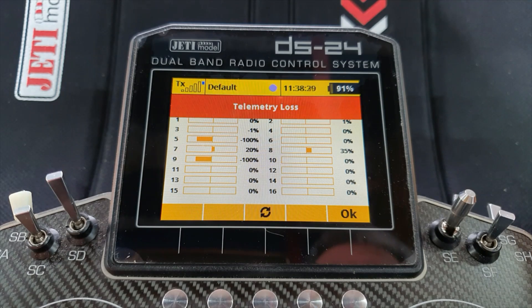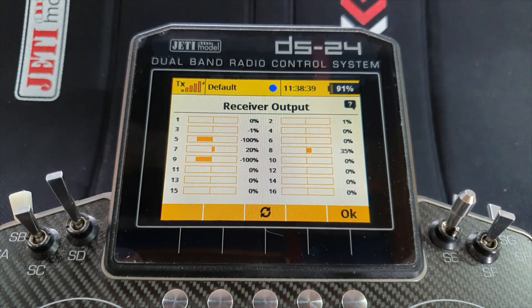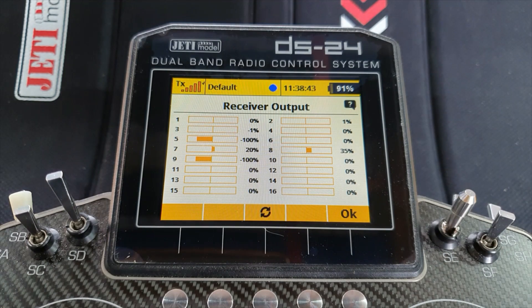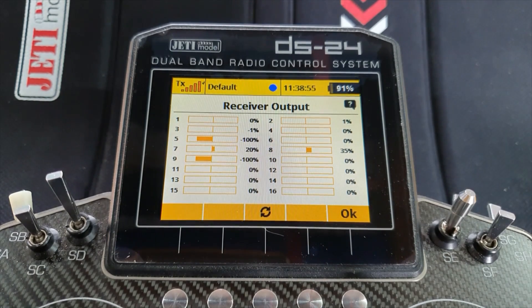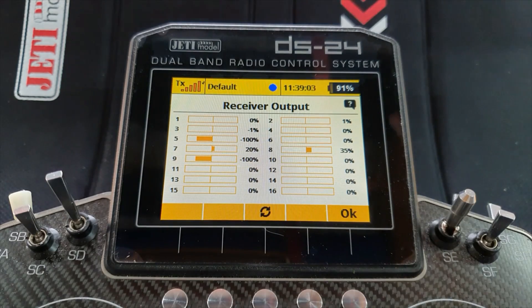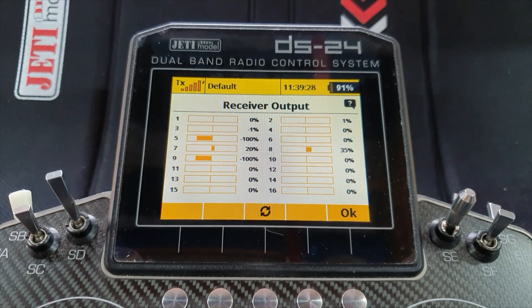I can get it set to the midpoint, then power up. Even if we'd left the throttle back, in an ideal world the motor would not have burst into life because the speed controller should recognize it's come to life with the throttle not at the zero point. However it's not wise to always rely on such things working - hence taking the propeller off. Throttle lock is off, so if I give a little bit of power - remember only use a tiny bit because there's no propeller on here, you could very easily run the motor up to huge RPM. It runs forward, stops, and runs in reverse. That's working - we've proved it's going in both directions.